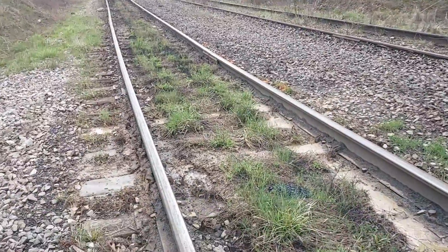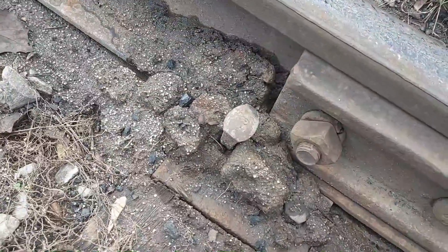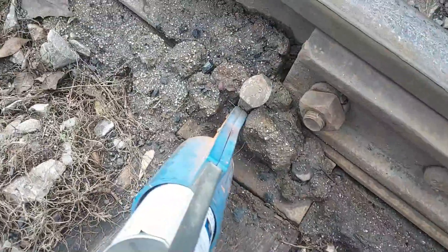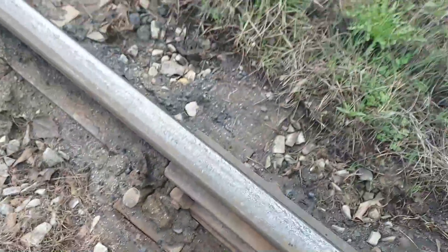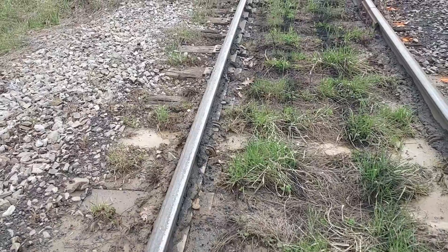Here's another criteria I look for, and that's a high spike. I can drive that back down in there, but what's happening is moisture's getting down in that spike hole, and that spike is not holding. I can almost pull it out with my hand. That tie's getting replaced. I painted it walking down from the loadout. There you have it — we'll go up here and see what else we can find so I can show you.